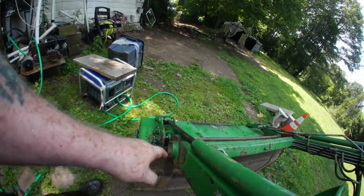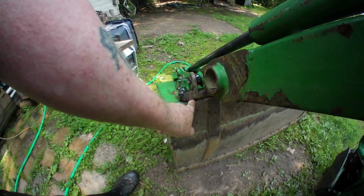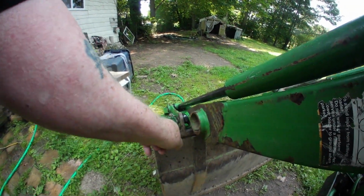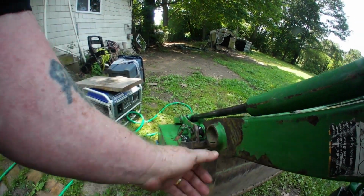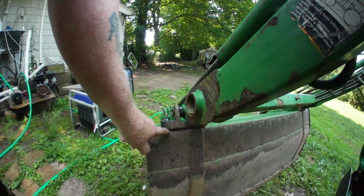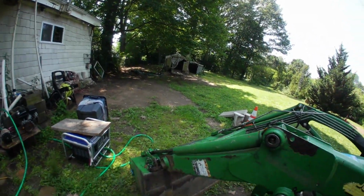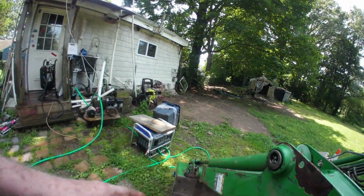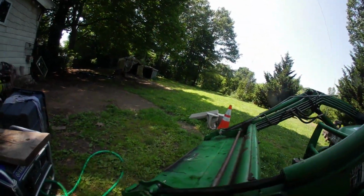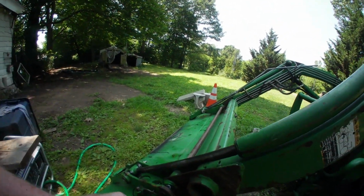because between the lift arm here and the bucket, this plate, the pins start to wear, not so much the pins, but the hole and the plate that the pins were sliding in. The plate started getting a little divot in it and the pins started to wear a little bit. And it was giving me almost a half inch of slop in here. So what I did was I took a piece of rebar. I'll show you the video anyway. And cleaned it down so it didn't look like a rebar. And I made it just enough to where I could slam it in there and fit it.